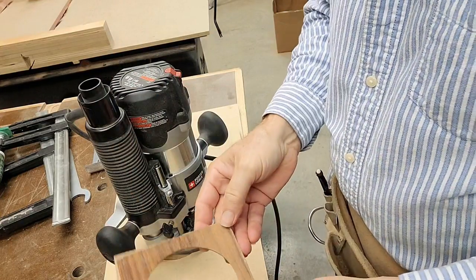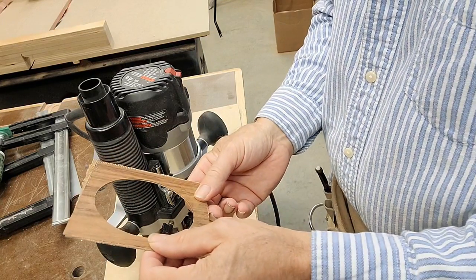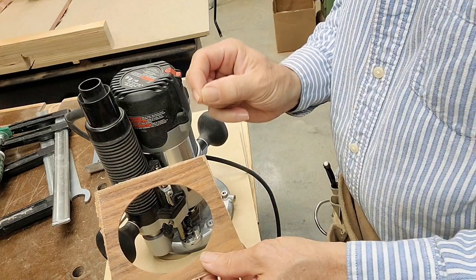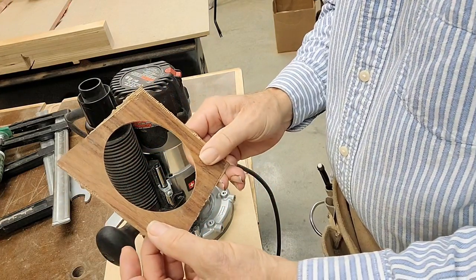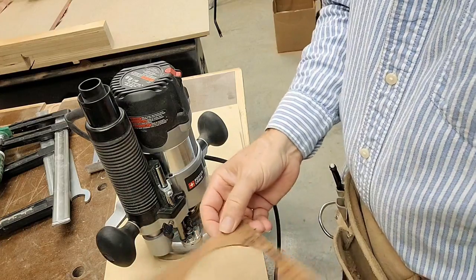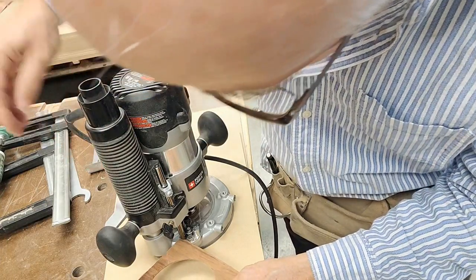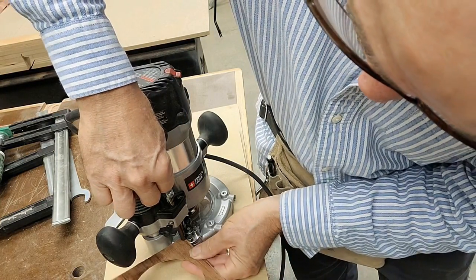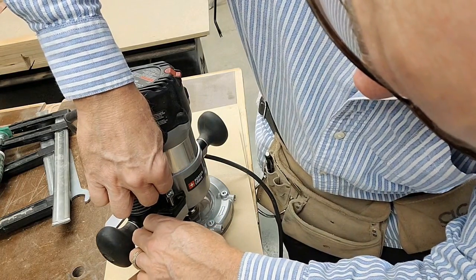And what I'm going to use to set that is I've got a piece of the scrap that I've cut off from the inlays, and that's going to be the right thickness. I mean, you really want it to be just a little bit shallow so that the inlay is sticking up just a hair so you can sand it down flush. And so what I've done here is I actually sanded the surface a little bit, and I used my caliper and I sanded off maybe 5/1000ths of an inch. Took, you know, really quick. And then I'm going to use that now as a shim in here to set this depth. And so drop this down. I'm going to really push it in. I'd rather have it be a little bit too shallow than not deep enough, really.